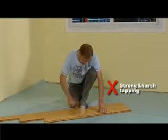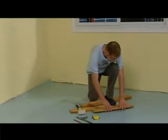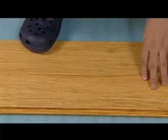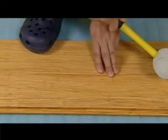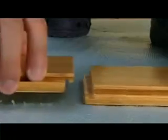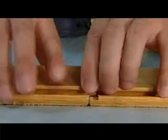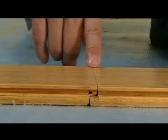3. Tapping with too much force is forbidden, and tapping should start only when the up hook of one panel is fully positioned into the low hook of another panel. When you've finished one row of panels and proceed to a new row, please make sure up hooks and low hooks are completely engaged with each other, and the locking function is activated.